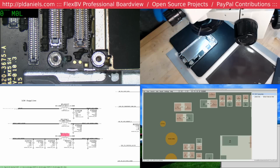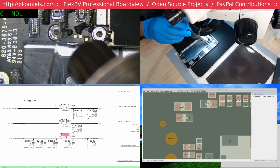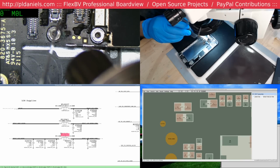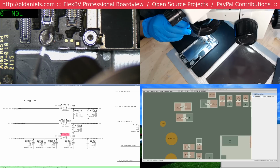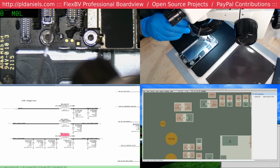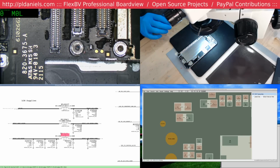Oh yeah, I mean the connectors themselves are completely botched. It's amazing that data, well, the data probably has destroyed many phones. But I can feel this is very crunchy, so we've definitely had a nice size short going on down here. Combination of corrosion and shorting. Oh, and away it goes. I did not really touch that at all, it just flew off free into the breeze. We've also got some long screw damage down here too. That's just hilarious what these people do to these phones.